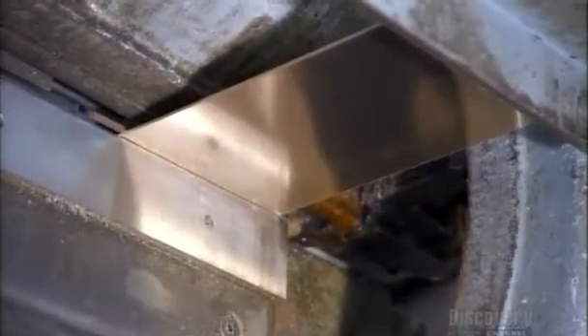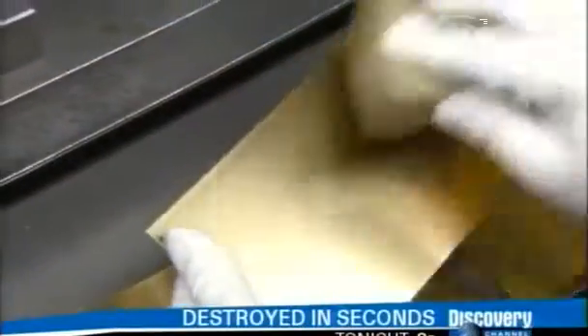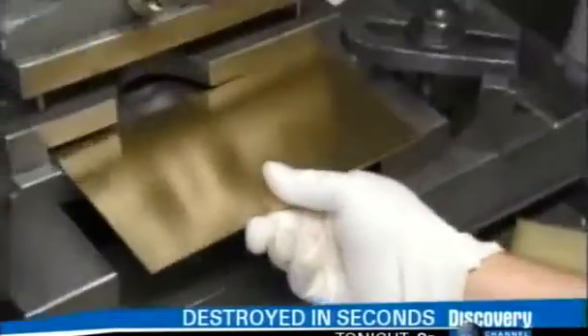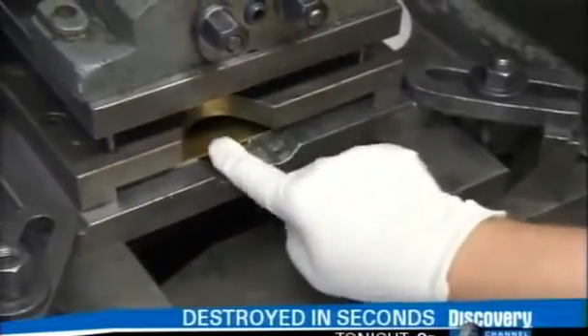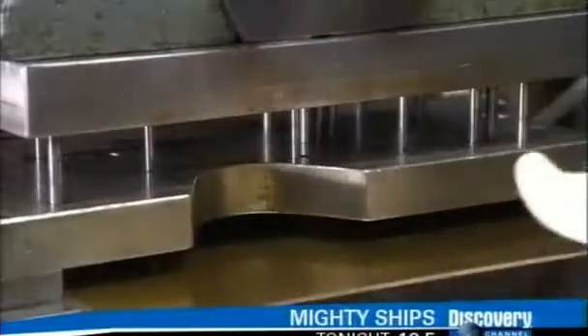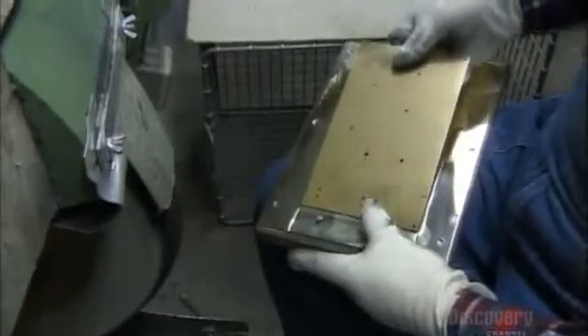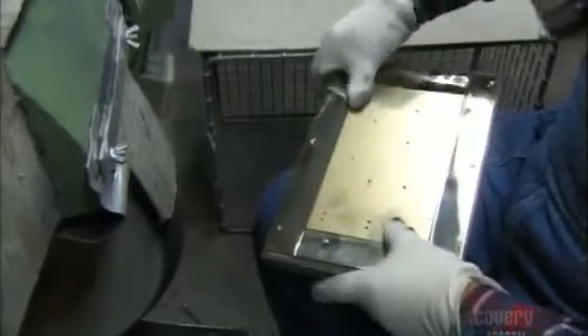The barograph's mechanism rests on a solid brass plate that's 214 mm long by 125 mm wide. A worker greases each one, then places them on a press that punches out holes for the fastening screws. Next, he places the plate in a metal holder and buffs it with a rotating polishing brush, applying wax to the brush to help achieve a perfect mirror finish.